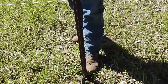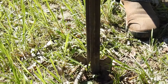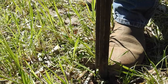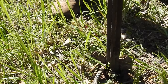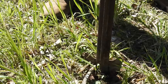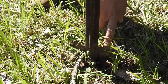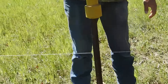And there it is. This was one of the first poles we tried to put in the ground, and now it's the last — it's the hardest one. And that's all she wrote. To keep a nice uniform line for the top of T-posts when running wire, you need to have these all flush with the top of the ground so you can measure consistently and keep your wire gap spacing perfect.